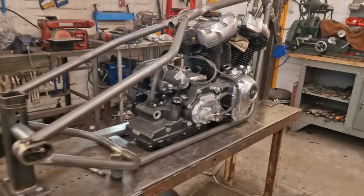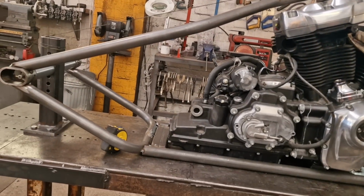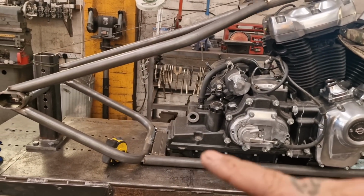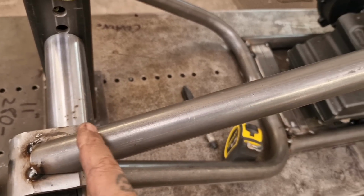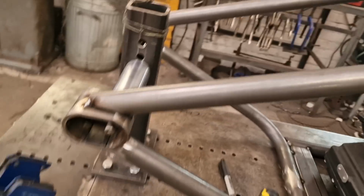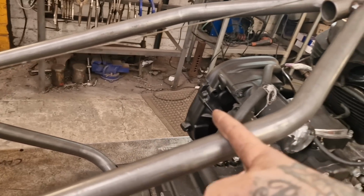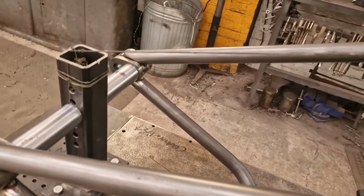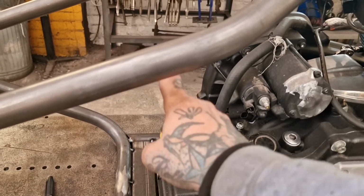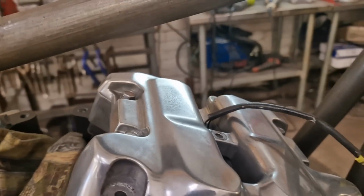Here we go, look. Got the seat rails are now in. Happy days. I'm just looking at this upright. There's going to be an upright in here somewhere. I'm going to measure back from here up to 14 inches from the spindle. That is furthermost point forward, and put a cross piece in, and that'll mark an inch in front of the tyre, like when the wheel's right forward. Same as this one does. This is about 14. Near as it is to swear in. So we'll do that, and then we'll look at this upright and this cross piece. And I've spoke to Andy.